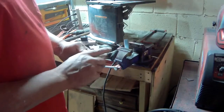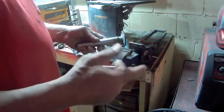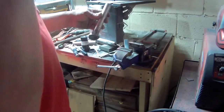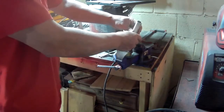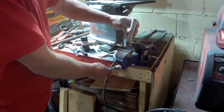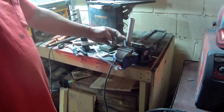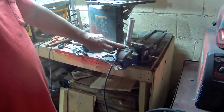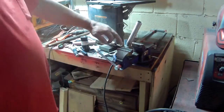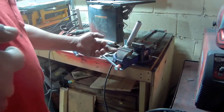So I went ahead and welded this on. Earlier I said it crossed my mind about the exhaust — it actually slipped my mind, totally forgot about it. It's been so long since I worked on this bike. Okay, what I need to do here is make a really big curve, a bend on this pipe, because this goes into the engine and then I need it to curve back to come underneath the seat and out the back.